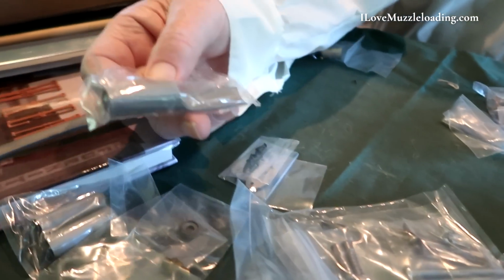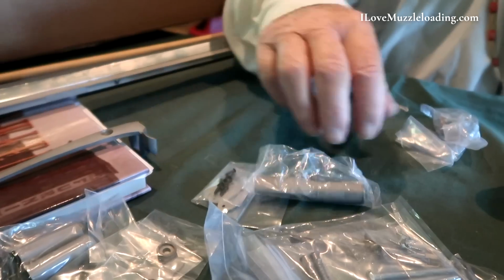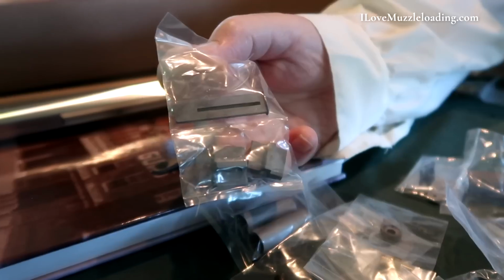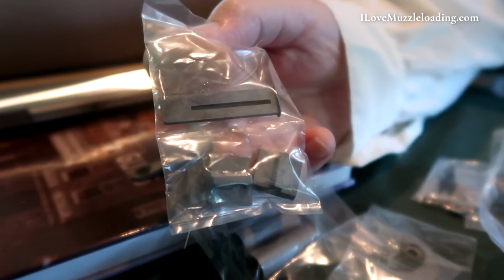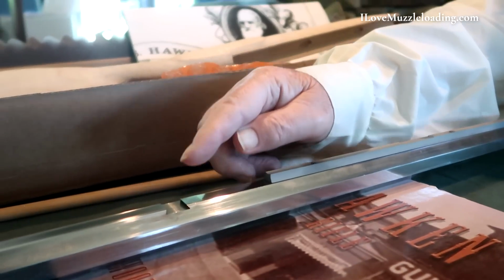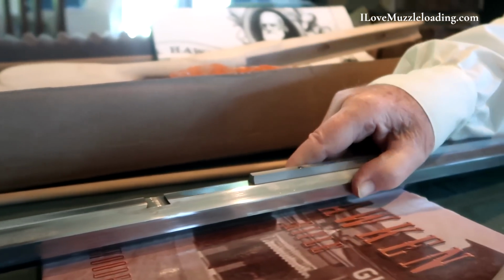This is the rear entry thimble. It's the right size, the right shape, it has the right contours. Here are your two barrel keys that you'll position and put in. There's two slots for the wedges to go through, and that's cut on the bottom of the barrel. All you do is slide them in here where we've made the machine cuts, pound them in hard, and then maybe take a chisel and hit this a couple times so they won't go back and forth.